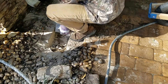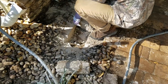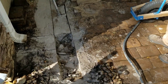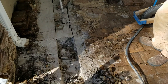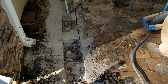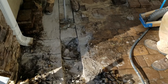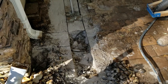This is a really thick pour — I think this was a carport at one time, so it may be a little thicker than the standard three-and-a-half to four inches. But you can see how easy it cracks. Remember, there was already a layer of pavers on top, so we had to cut the concrete it was sitting on to get our drain down below. We'll remove all of this, trench it out, and we're getting closer to laying pipe.